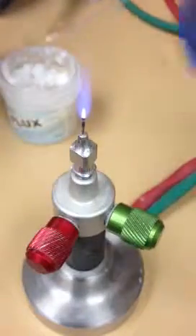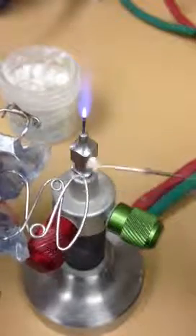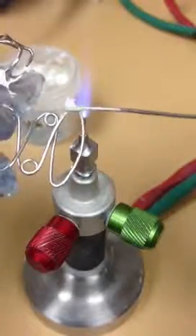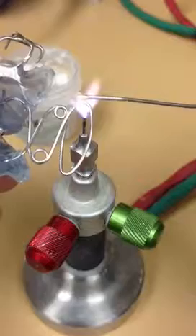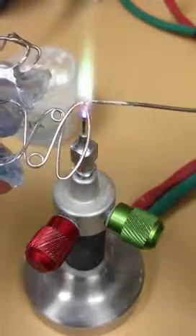Make sure that your wire is clean. It's good to have a little bit of flux on the wire where you're going to add it. Then basically you just heat both wires together. When the solder flows, it'll connect the two wires together.